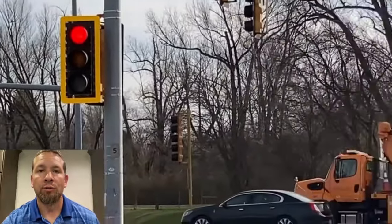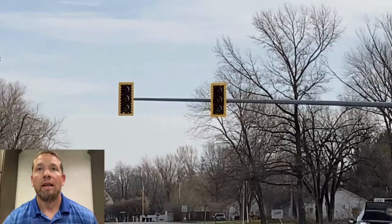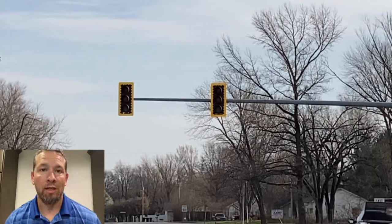I'm going to give you a live play-by-play of what happened here. I was called at this intersection because it was reported flashing red and green for the same direction — we'll call it eastbound. As I panned through there, there were two heads that were dark. Through my isolation and elimination process, I isolated down that these two dark heads were causing all the directions to do this.